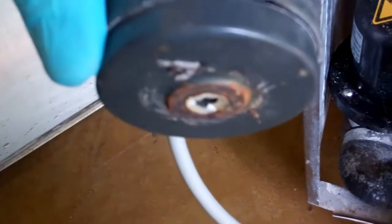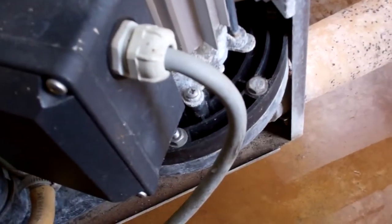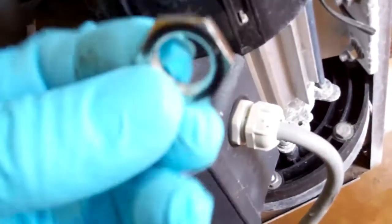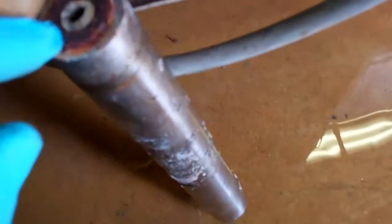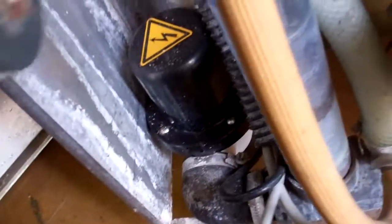These things work on air pressure. As the water goes up on the outside of the tube, the air pressure goes up inside — it makes a little switch work. It should have a thread on there like this. What happens is they come out with this metal nut on there — that's the new one. The old one goes rusty, expands, and snaps the plastic off.